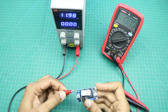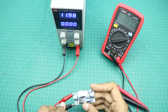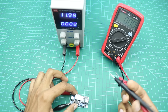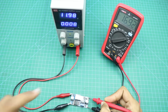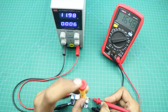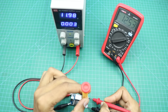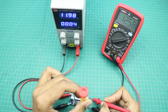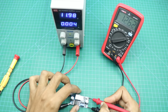Connect the module with a 12 volt power supply source and then adjust the output voltage to 12.6 volts. As you can see, it is currently at 16.9 volts, so we will need to adjust it. Now do the same for the second module.